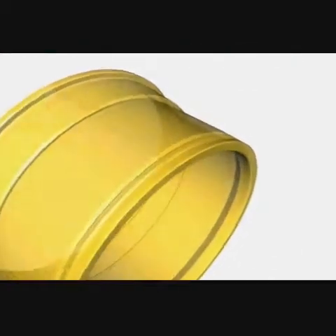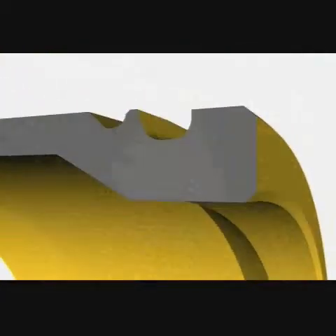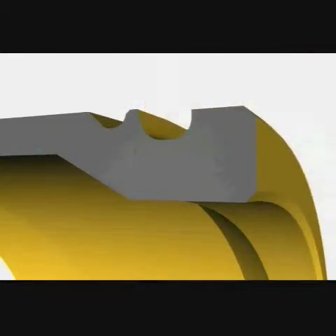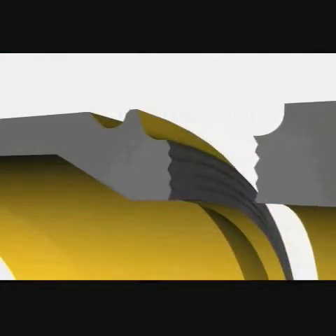The location of the crack in the rim base is now shown. The lock ring fits into the lock ring groove in the rim base. The crack in the rim occurred at this point and caused the rim to completely separate into two pieces at the bottom of the lock ring groove.